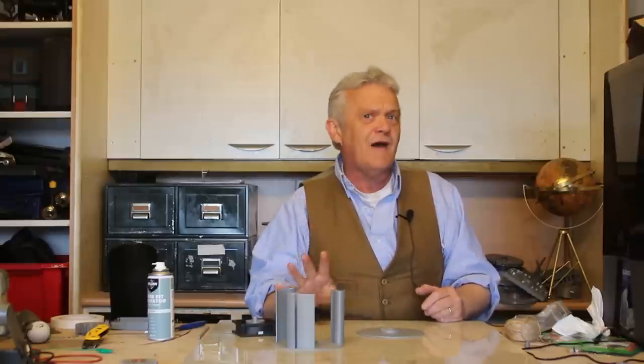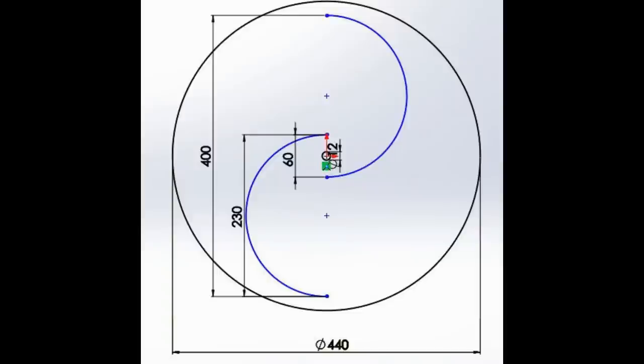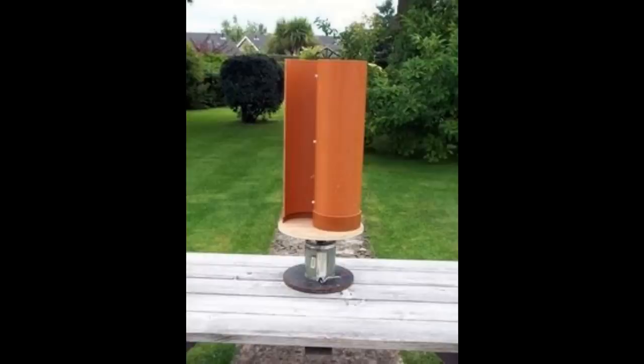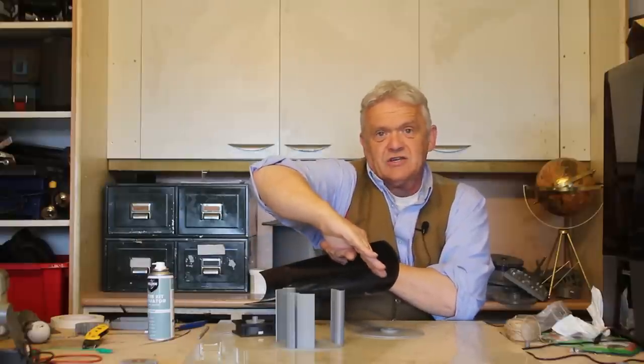It turns out that there are four variants to this C-Rotor. The simplest one is called the Thane Rotor, from a school in France, and it's based on a very simple Savonius. The Savonius is just a half-cup shape, and what they did was stick a flat plate projecting into that cup. They got a 36% improvement on the Savonius Rotor, which is really remarkable. It's also super easy to make — you could make it from half a barrel or a piece of guttering.